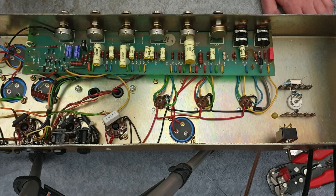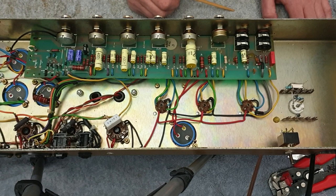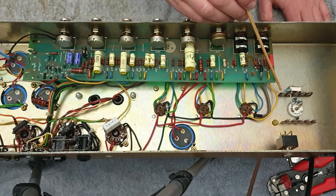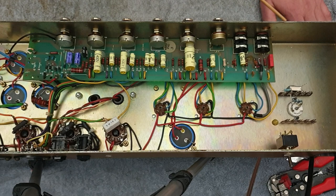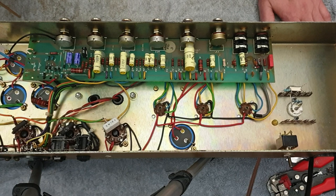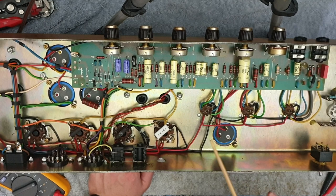A couple of these grid stopper resistors have been replaced - a couple of originals, a couple of new ones there. Here we've got this preamp tube that's been added and it almost looks like it hasn't even been used. There's no solder on this part of the tag board. A couple of components added to this one. It looks like maybe they used one side of the triode for an extra gain stage, but it looks like it's been restored fairly nicely. I'll flip this board out and make a start on the Jake E. Lee spec mods.